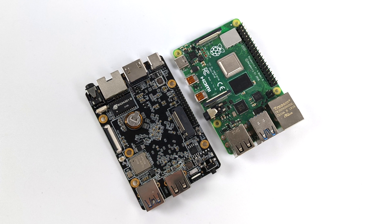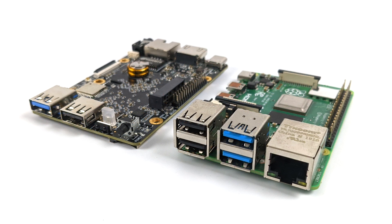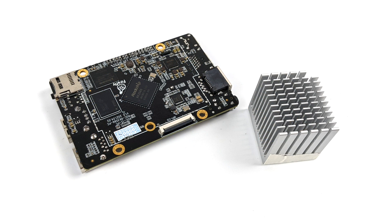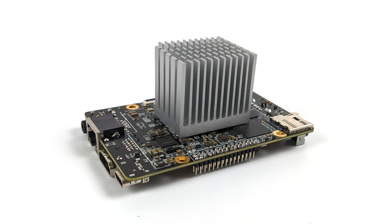Since this will be compared to the Raspberry Pi 4, here's a quick size comparison. The RK3566 board is a bit larger in footprint, but it's lower in height since we don't have stacked USB, though we are lacking some IO. For testing I'm adding a cooler to the Firefly board — it's overkill, but it ensures no thermal throttling while gaming or running benchmarks.